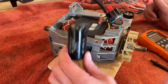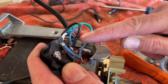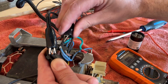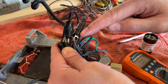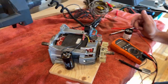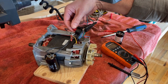We know the capacitor is good — we've tested the capacitor and tested our circuit. The thermal switch, even though I have continuity through here, if I test this, continuity is good. What we do know is you can actually just wire all of these wires together. We're going to jump across — this is actually the circuit for the capacitor — and you'll notice the thing fires up just fine. So we know our thermal safety switch is shot. We'll be taking this out of the circuit and replacing it.